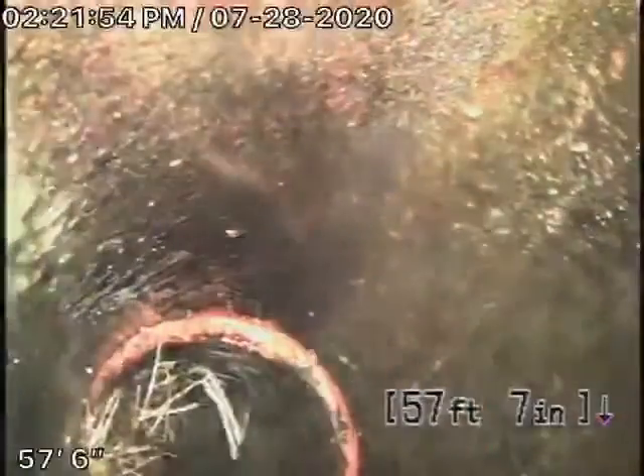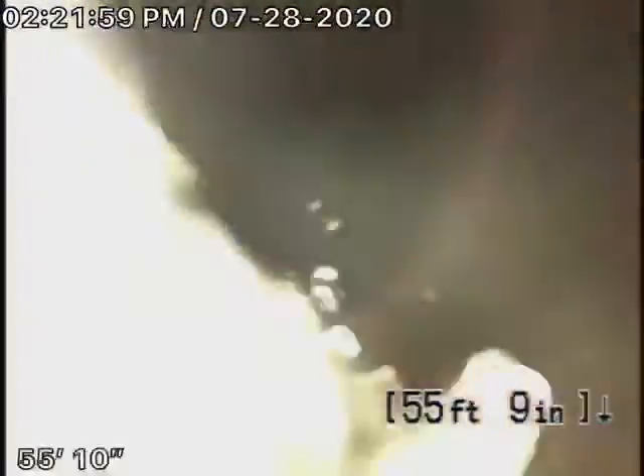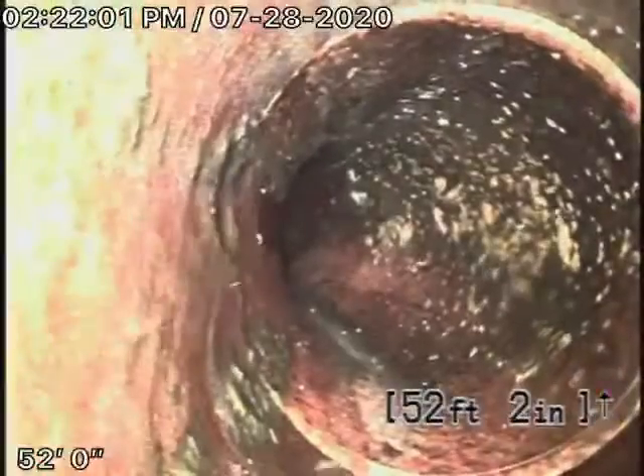This comes onto the property right now, where it comes to a 4-inch clay pipe. There are some roots over here, a little bit of roots coming in, dives down over here as it straightens up — 4-inch clay pipe in the front yard underneath the grass area.